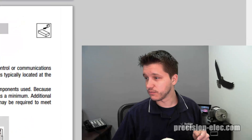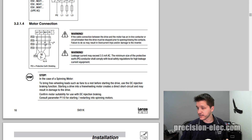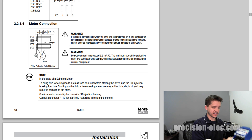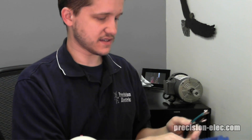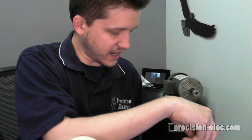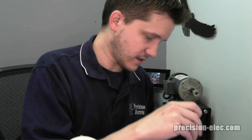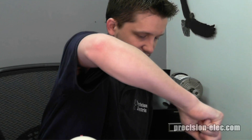It's always important to consult your manual on your motor wiring because you want to make sure you're landing it to the right terminals on the drive. I'm going to scroll to the motor connection section of my equipment. It says right here that I need to wire to U, V, and W — or T1, T2, and T3. I've already got my input voltage which we wired in a previous video. On the left-hand side I have U, V, and W, and I'm actually going to wire these to those particular screws. What I usually do is unscrew them first and put the wire in. You don't want any frayed wires, so twist the wire if you need to in order to get it in there.